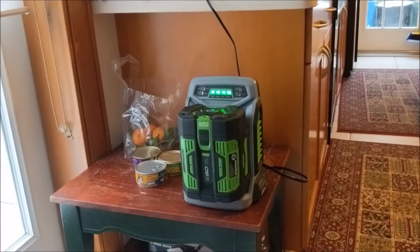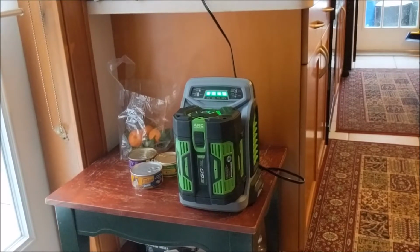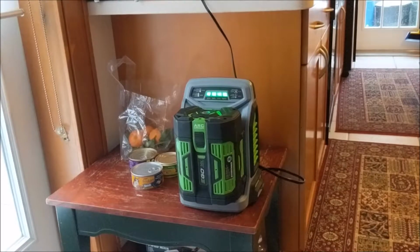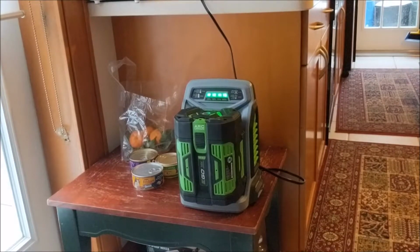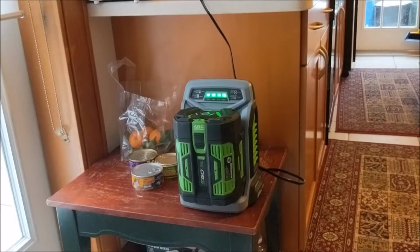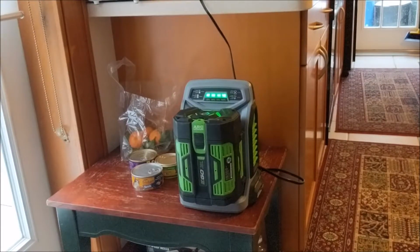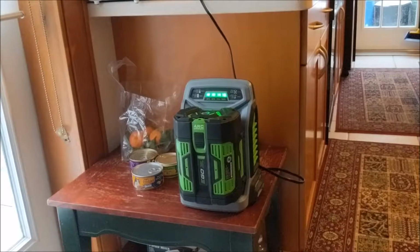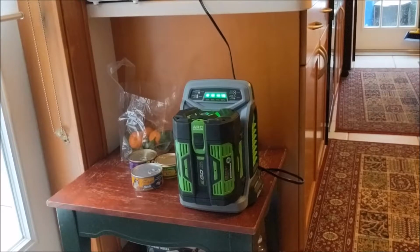So what you want to do, for most batteries of lithium composition, is to fully charge them, let them balance, then use them immediately. Don't keep them charged for a long time without using them. Use them down to about half or whatever you think the percentage is, even a little bit is fine, and just let them stay until next time you need them. Before you need them, charge them up and use them again. This will prolong the life. Try not to fully discharge them.